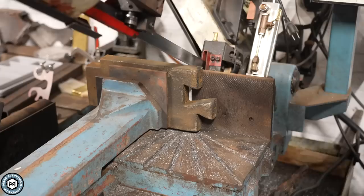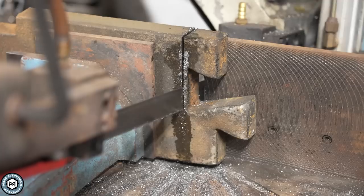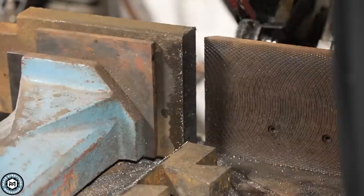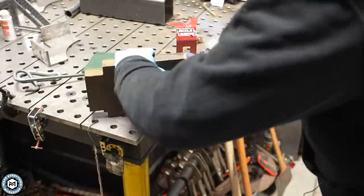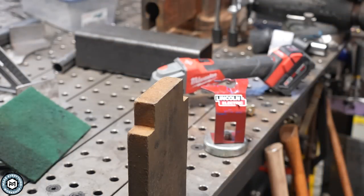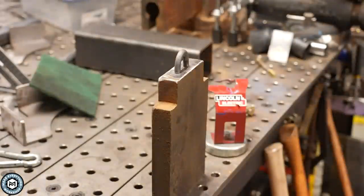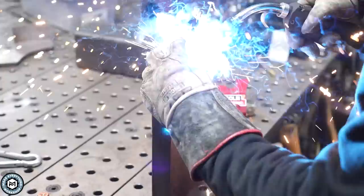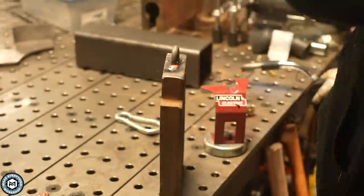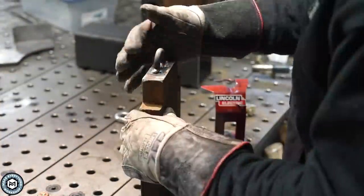Next, I'm going to take this old elevator weight that I got from an old job and cut it on the bandsaw. It's got a keyway on the end that I want to get rid of, so I lubricate it up with some three-in-one oil and give it a cut. This also sat in the rust-removing soak, but it's starting to flash rust a little bit because I didn't coat it afterward and I left it on the floor, which is pretty wet. I grind the end a little bit, then take one of those test bends I made and weld it up to the top of it. The goal is to make sure it's nice and centered so the weight hangs very square, because I don't want it to hang on an angle or dangle or kind of move around. I give it a tack weld, check and hang it, and then fully weld the rest, burning in a good amount of heat to penetrate that inch-and-a-quarter thick solid steel.